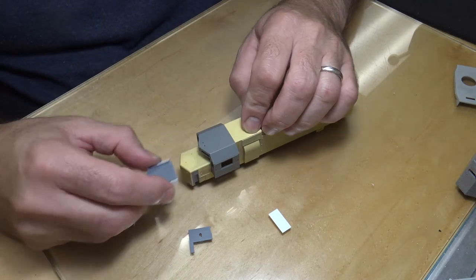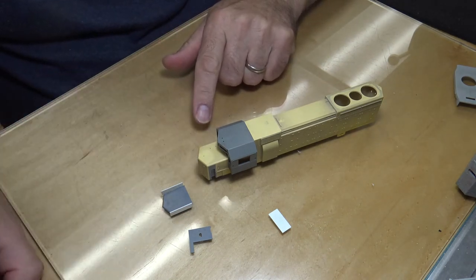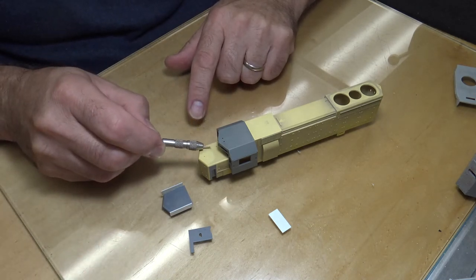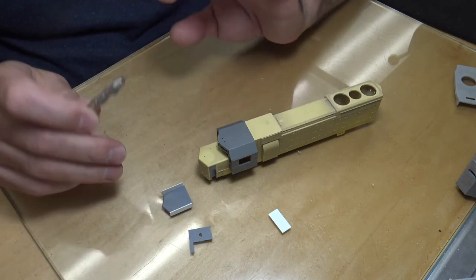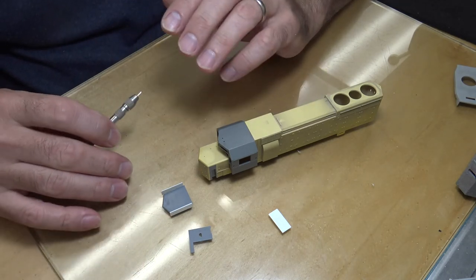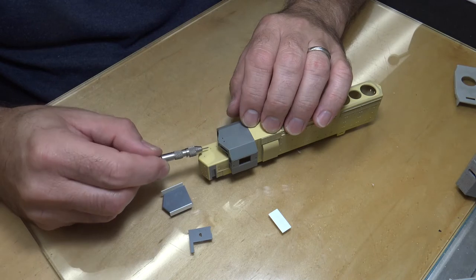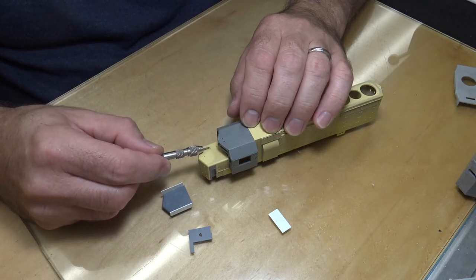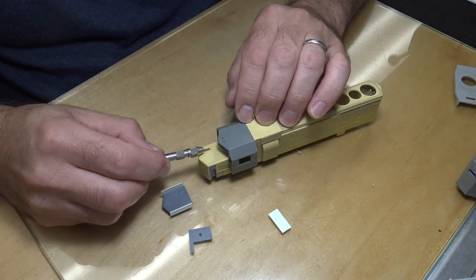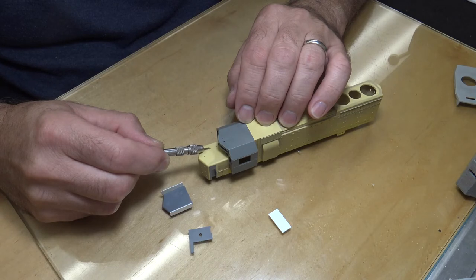Now, something you need to know, on most EMD units after the GP35, this is a drop grab. On the GP35, it is not a drop grab. So what happens is there's a spec that EMD has to follow. I don't know if it's an OSHA spec or just a common sense spec, but for somebody to reach to this grab iron, this drop grab is over where these bolt holes are. Well, when it's a straight grab, it's a couple inches back. So what you have to do is drill the holes where the bolts are for the drop grab